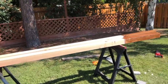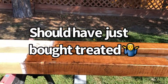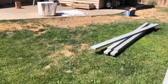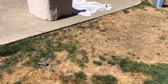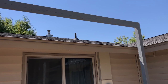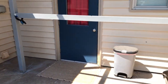The next step is treating the part of the 12-footers that are going to go down into the ground. That's the first coat of treatment on there - I'm just treating the part that will be underground. Because of the angle of our patio, there are going to be two posts actually in the ground. We got the first piece vertical, and there are the back side supports installed with the 2x6 on top. They're attached to the ground now.